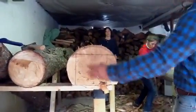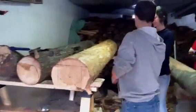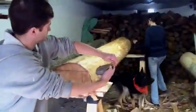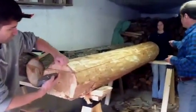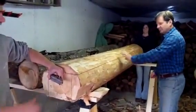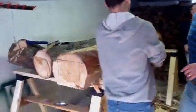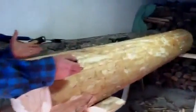What we need to do, we have this same square down there, and we're going to chalk line this. So Joe and Allie will chalk line it for you. You have to pull this nice and tight. So we put nails on each side, and you get out any of these little flaps so that they don't get in the way of the chalk line. All set? Yeah. And then just a nice, beautiful, nice red line goes across here. Now we did this to the other side also. So there's two chalk lines going across here.